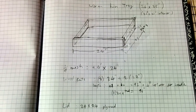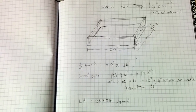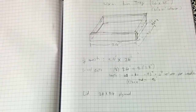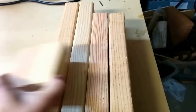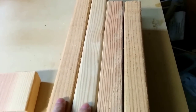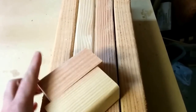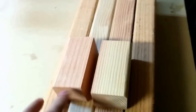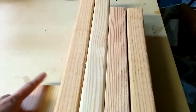Let's go into the process of making it. It's very simple — just make four cuts on the 2x4 and another cut for the mesh, then fasten the hardware cloth to the tray. From a 2x4, cut it into four pieces — two 22-inch and two 24-inch — and you'll have about a four-inch cut-off, which you then cut into two pieces for the handles. For cutting, I use a miter saw, but you can use a circular saw, a jigsaw, or even a hand saw.